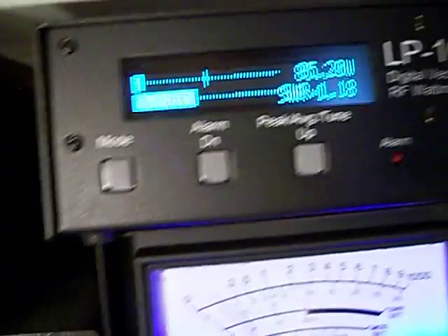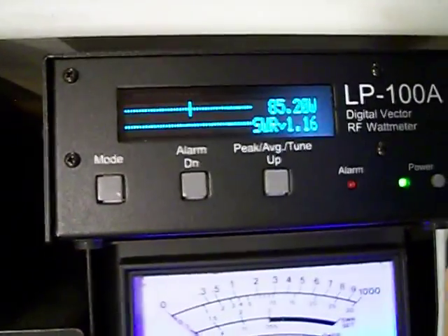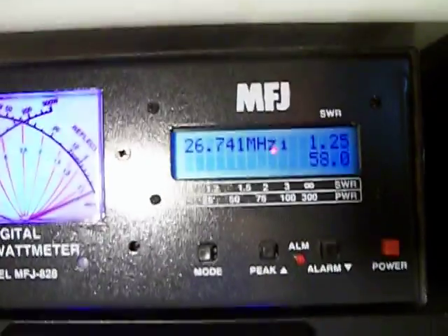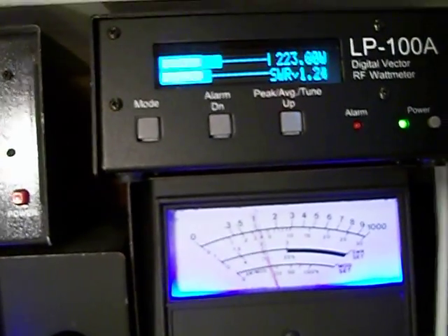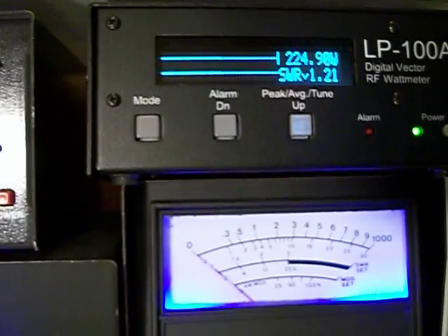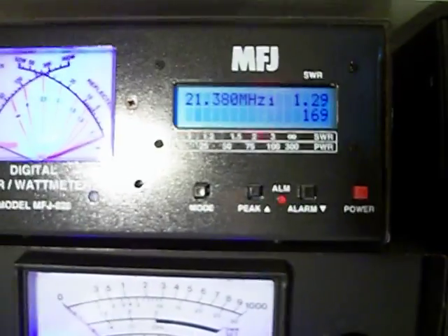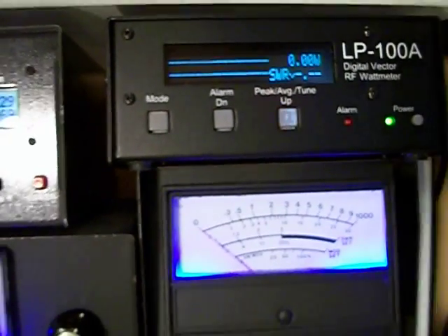Hello, hello — audio test on the radio. The radio is doing maximum audio at 85 watts and the carrier is about 58 watts. Now I'm going to turn on the driver. With the driver on, it's set at 224 and the dead key carrier is about 169 watts — that's really good.